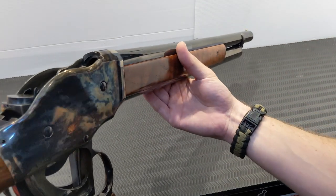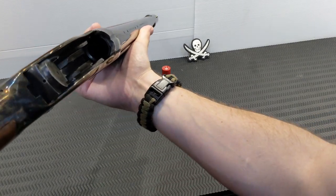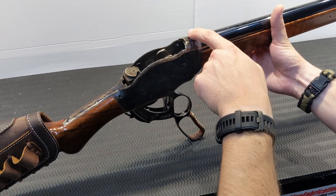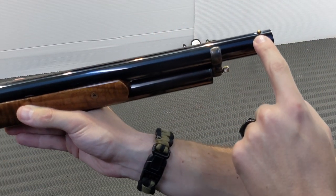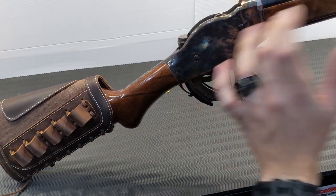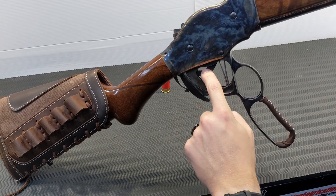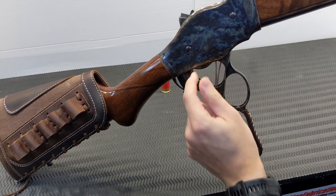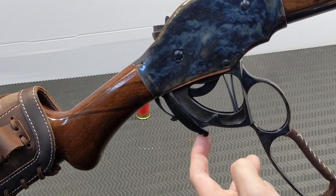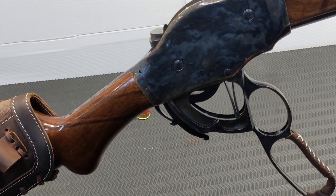Another really cool thing is when you cycle it all the way forward it gives you almost perfect access down the barrel, so if you need to clean it or get any lead out, it's almost perfect. There's also a notch in the top of the receiver to sight with the brass bead on the front — you do sit quite low. The steel butt plate has color case hardening as well, continuing that theme. With the action open you can see the hammer, the main spring, the trigger, and the sear with its half-cock and full-cock notches — all the internals are exposed, which is pretty cool.